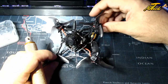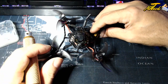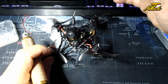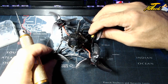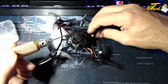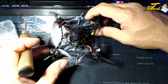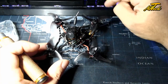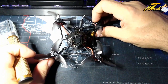So do I recommend it? I've not had the best experience just because I had some DOA components, but that happens to all of us — sometimes stuff slips through QC. Now that I've got it flying, I think it's okay and it's fun. I did crash it a few times and it held up. The flight controller is decent, good headroom, no noise in the feed from the ESCs — that whole flight controller board is really cool and definitely worth using. I do recommend thinking carefully about your receiver choice. If you want to make use of that 200 milliwatts, get something with diversity or decent range. Motor choice is good for this, but I do feel like this quad is a little bit overweight and I think that's the biggest problem.